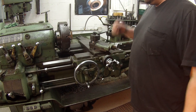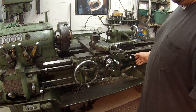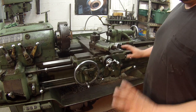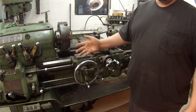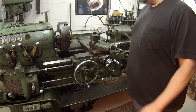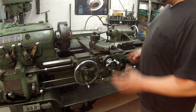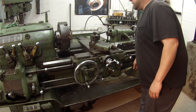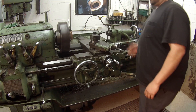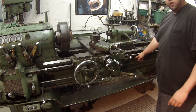The other thing to keep in mind is that I don't change this when I'm running really fast. I try to keep the RPMs to a lower level when I change it, because you can hear those gears engaged down on the end. We're running 200 RPM — that's right about the high end I like to change this at. So we'll go ahead and turn it on and you can see the feed rod that's moving here.